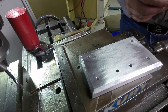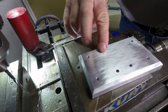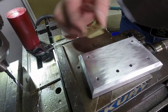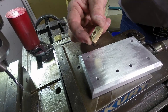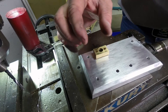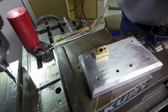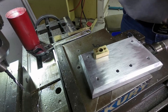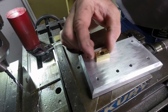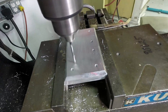We're back at the mill to drill and power tap a couple of holes. We're going to have two number 8-32 screws going right here where I've got these two center punch marks. I cut what I thought was a piece of copper from some old stock, but it wound up being brass — brass works just as good. It's going to bolt right here and be a little light — kind of a pseudo light pole. When the generator spins and illuminates a light like it would in the city, that's the idea. I dressed it up a little with the grinder and drilled a couple of holes in it — essentially a piece of brass tubing held down by two number 8-32 cap head screws.